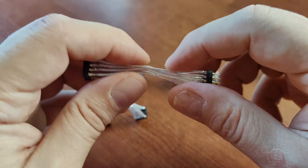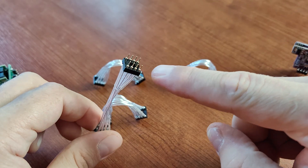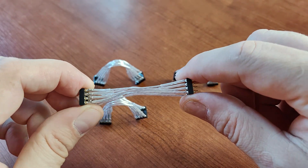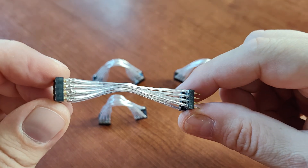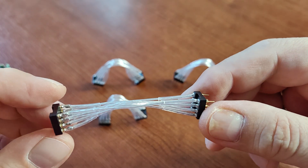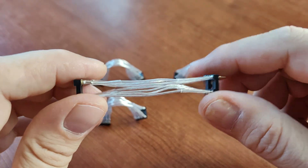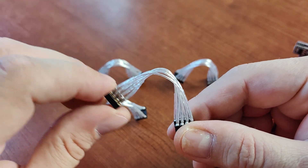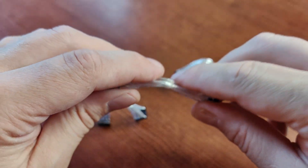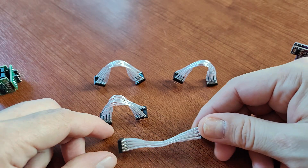Like this one — I wouldn't even call them complex devices, they are very simple. You have one DIP socket at one end, a second DIP socket on the other end, and wires connecting the sockets. The wires in this particular one, which I'll link in the description, are supposed to be made from OCC copper that was silver-plated, and they are quite thick, which is a good thing because you may want to position your op-amp and shape it a little to choose the position of your operational amplifier.